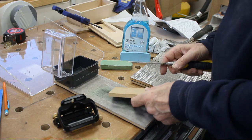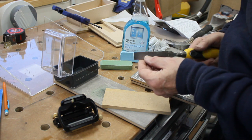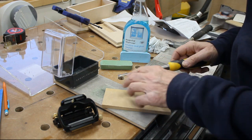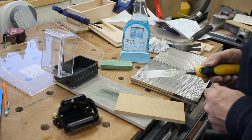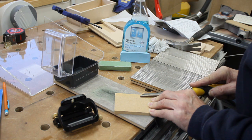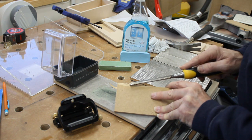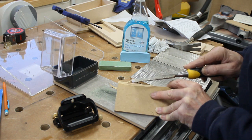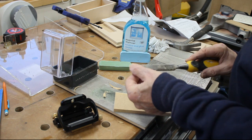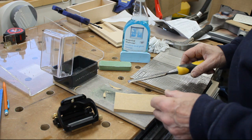I've spent about a quarter of an hour at most on what was a particularly poorly sharpened chisel. I flattened the back, done a job on the front with the four stones, and just honed it with the compound as well. I've now got a chisel that will happily take chunks out of MDF. To give an indication: before I could rub it on my hand, I wouldn't dare put it anywhere near my hand now. You see folks shaving with them — I'm not going to start doing that — but it has put a particularly good edge on it.